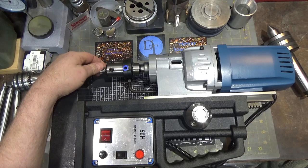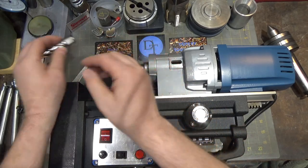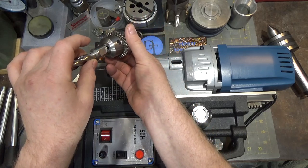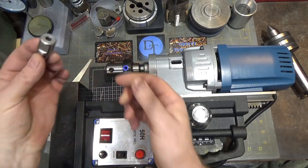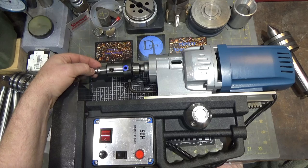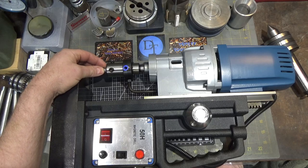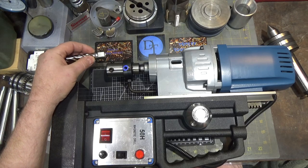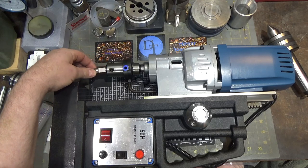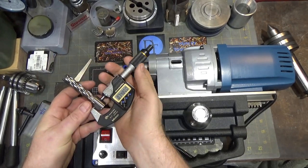Also, the bore of the hole is larger than the cutter. When you're tightening from one side like this style and you push the cutter against the other side of the bore, you're shifting it off center automatically — which is a horrible design. With a three-jaw chuck you tighten from three sides and it auto-centers, but here tightening from one side means this needs to be ground pretty accurately. Let's measure and see what we get for those values, starting with an inexpensive annular cutter.